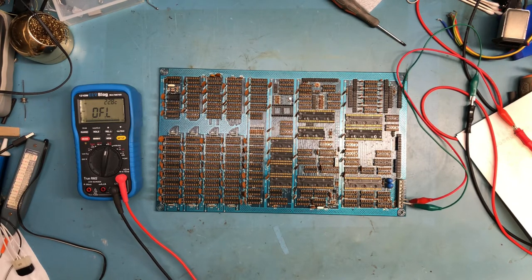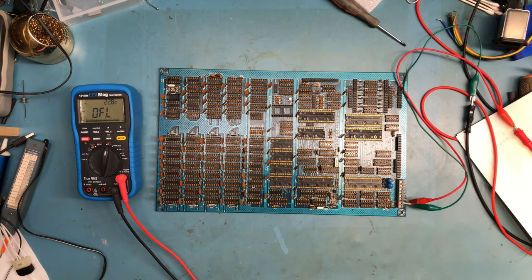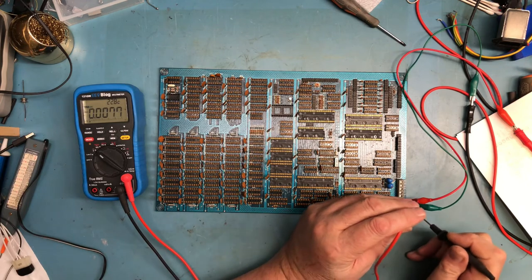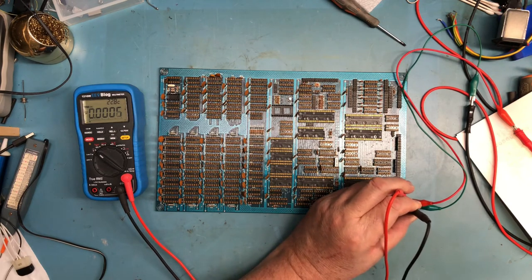And right now, the current limit's set at 1.2 amps, which is way too high. There's 100 milliamps. I want to get back to volts. That's AC. I want DC. Supply, and it came up to 5 volts, and it says we're drawing less than 10 milliamps,